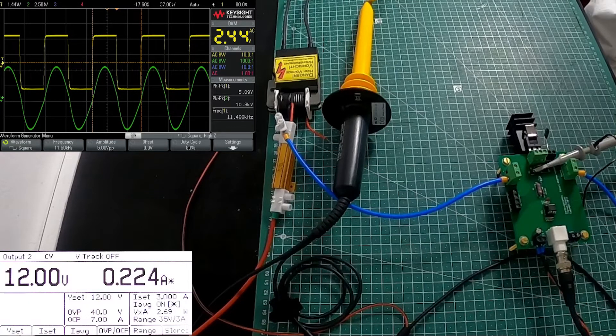These spikes are also consuming energy, and that energy is dissipated in the MOSFET — which causes heating. At higher power levels you would require a fan, adding more unnecessary power consumption. Using proper circuitry for your system we can avoid that. Here we see a 300 milliwatt reduction in power consumption with the same output.